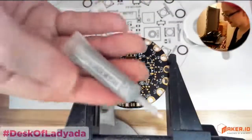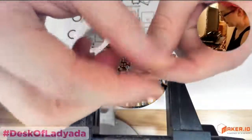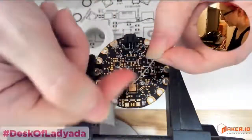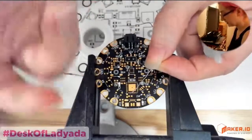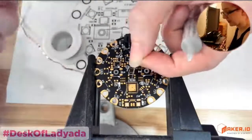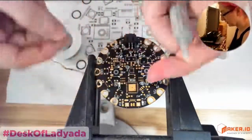It's kind of nice, because it's kind of heavy. You have solder that comes in a wire, right? Inside, it's very hard to see, but there's a little hole that goes all the way along the wire, and it's stuffed with rosin, the flux. As you solder, the outside metal melts, exposing the flux, and the flux is what makes the smoke, and it cleans off the area so you get a good solder joint. That's why you want rosin core flux. You can't use acid core flux. That's used for plumbing, because it etches away at the copper pipe to make a good contact, but it'll destroy your electronics.